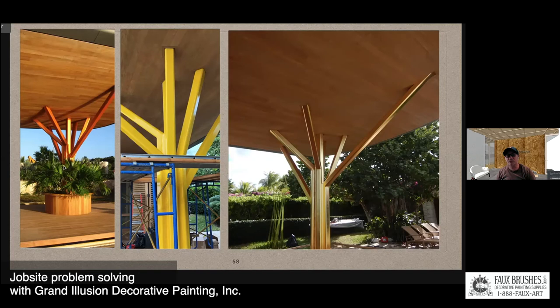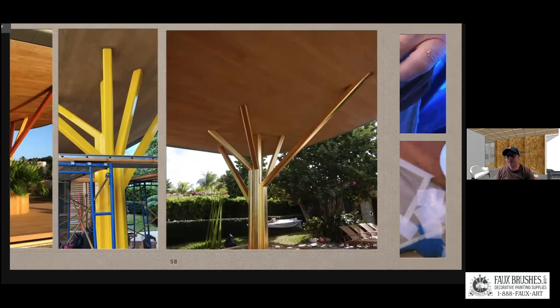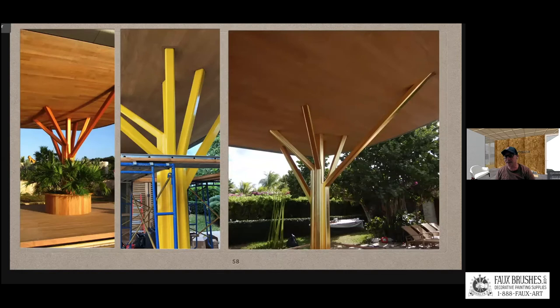When it's gilded nobody can touch it, or you varnish it — but varnishing kills the face of the gold. The client said no varnish, so we built a scaffold. Within three days they had a party and the gold was completely ruined. I said we'd re-gild it, but this time I'd lacquer it to preserve it. By then the scaffold was gone and I only had ladders. Wind was blowing salt water over the surface every night — I could not gild with loose leaf.